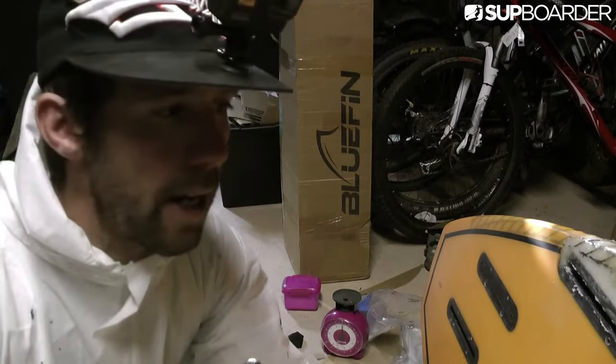So what I've noticed is that in a couple of spots I've just gone through the glass, so I'm going to have to just put a very, very thin layer of resin into some of the little voids that I've created, just to make sure it's watertight. Can't do that until it's nicely dried out, so I'm going to get this in a nice warm room so all the moisture comes out of the bits of repair that I've been doing from the wet and dry, and then I'll just finish it off with a bit of resin and a very light hand sand after that.